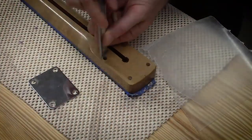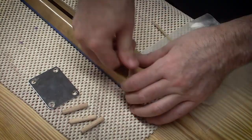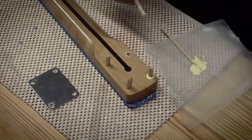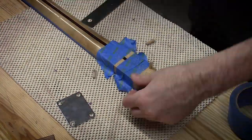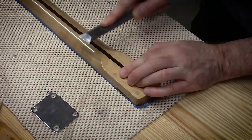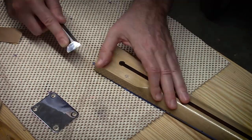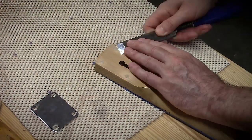I used the neck plate to help locate where the holes would be drilled, and I used some of the dowels to help hold the neck plate in place while drilling. I marked the depth of the holes on all of the dowels, then just glued them in place. Putting down a little protective tape and using a small pull saw to level everything off, letting it dry, then going after it with a sharp chisel and cleaning it up. This is something I should have done a month ago, but I couldn't resist — it had to be done.